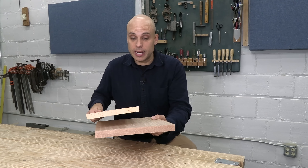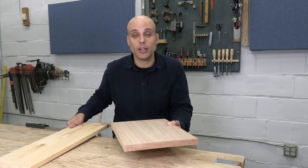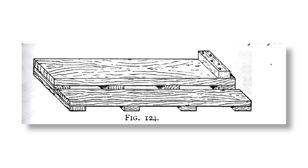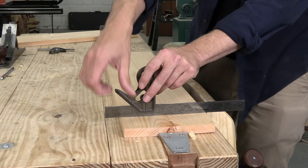You can try to fix this problem by laminating two boards together, and that definitely helps, but it's no guarantee. Even two laminated pieces of solid wood still might twist and cup as the seasons change. So instead, we're going to use another traditional design. This design combines flat pieces of wood with cross-grain battens attached with nails or screws. The battens keep everything flat, and we can make the board from two relatively narrow pieces — no need to dig up super-wide stock. The widest piece of wood is called the stage, and this piece needs to be very flat for the shooting board to work. This board has cupped, so I'm planing away the sides until it's flat.